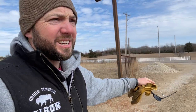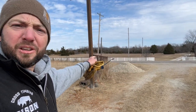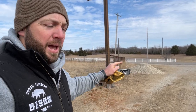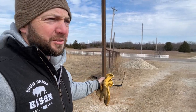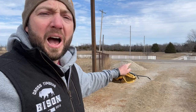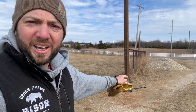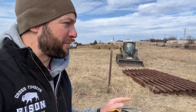So I'm gonna dig it down a couple inches. We're gonna set the cattle guard, and then we're gonna use the rock on both sides to make a ramp, because Richard and Kevin got some advice from experienced guys who have cattle guards not to sink it down in the ground and just cover the surface where it's completely flat, where you just drive and you don't have to go up. It's just a continuing surface. I said, don't set it because it'll eventually fill in and then you'll have problems.